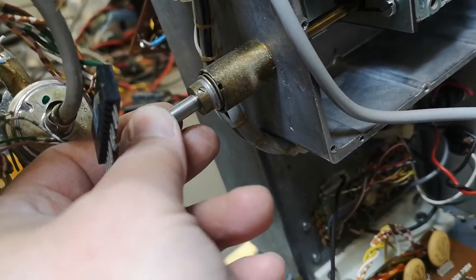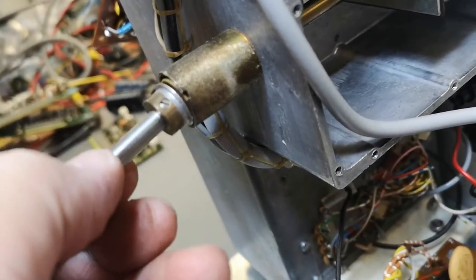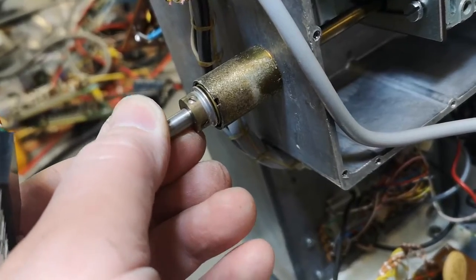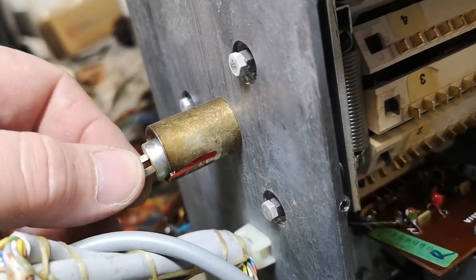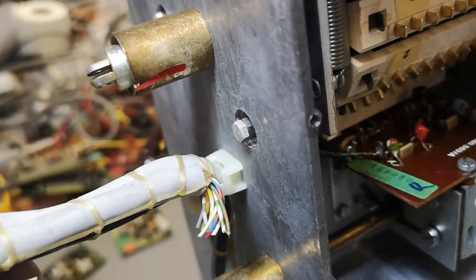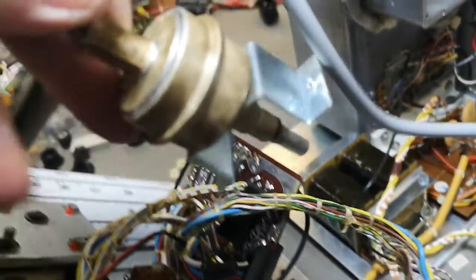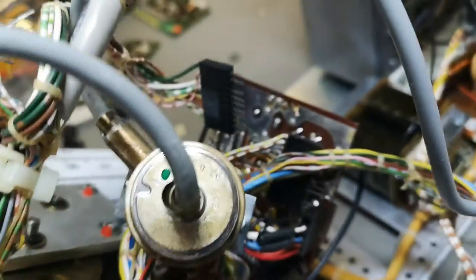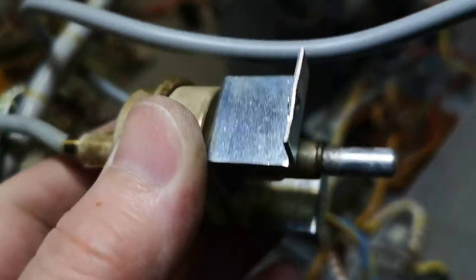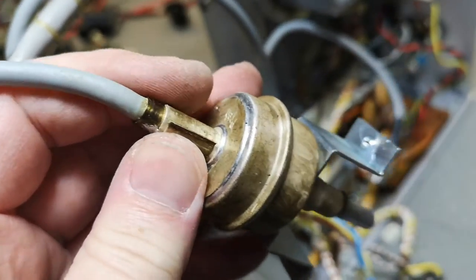What I found here to be really really cool is this flexible coupling — it's made in a really cool way. It's very flexible and yet absolutely without any kind of slop. There's another one on the main band switch — same style, really really cool. Now I need to have a little try-out with this pot meter here. It is a 60-ohm attenuator, not that far from 50 ohms, so I bet I'll be able to measure it. It's a linear pot meter without any click settings — I kind of like it, and it has BNC connectors so it should be fairly easy to test.